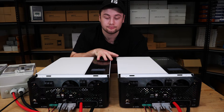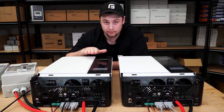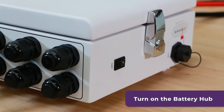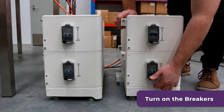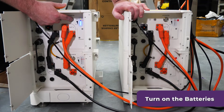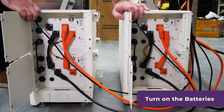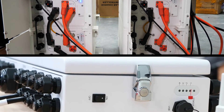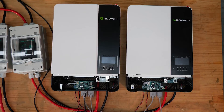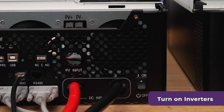Once you've set up the communications cables we need to program these inverters. Before we do that, follow the correct startup process: first turn on the MCCBs, then turn on the battery hub, then go around to the back of the lithium batteries and turn all of the breakers on. Then go around to the front, hold one of the silver buttons on the top battery — some lights will start flashing. Wait about 20 seconds for all of the batteries to boot up. Finally, move back to the inverters and switch them on.